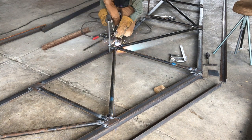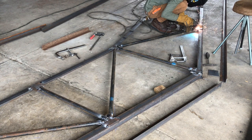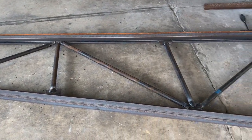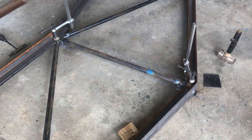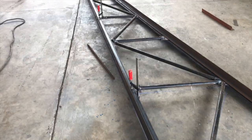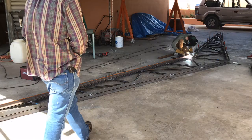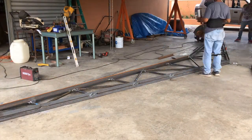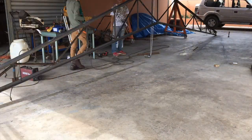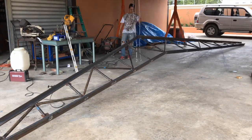We're just about to finish up the webbing on this truss, and we'll complete it by finishing the top part of the sandwich, as I like to call it. We throw on the pieces of angle iron to the top, clamp all the way along the edges ensuring they're parallel with no extra gap — all clamped down tight to the plate. I ended up doing part of the welding with 7024 electrodes, eighth inch, run at about 140 amps — they laid really nice beads.